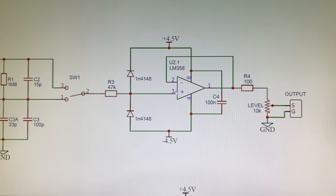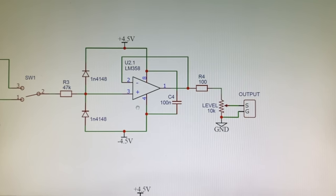And then you've got another unity gain buffer. This capacitor decouples the power supplies. This resistor — about 100 ohm — is to prevent oscillations and protect against short circuits. And this trimmer pot does the final adjustment of the level going to the sound card, which is your output.